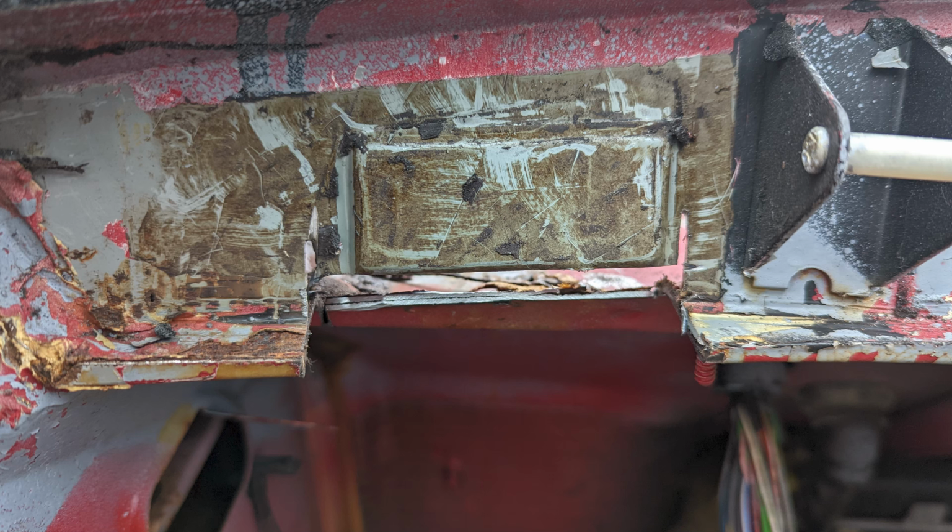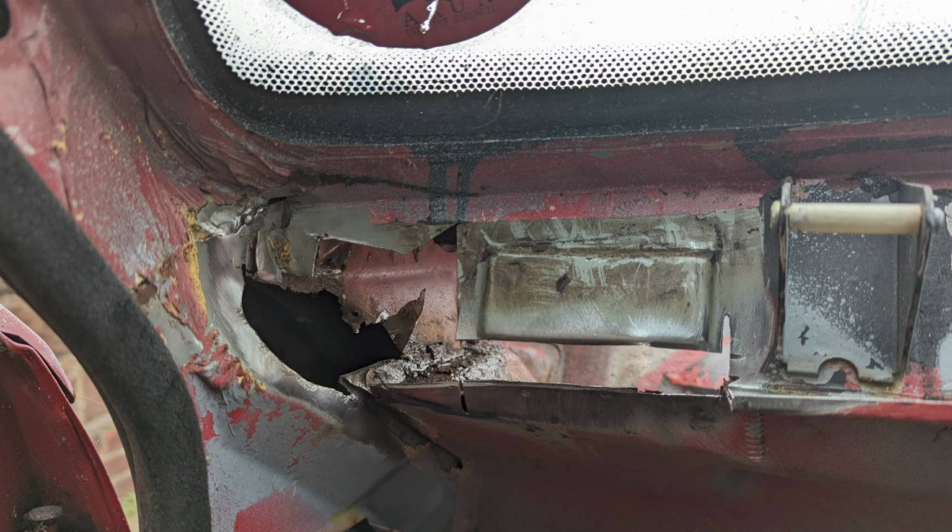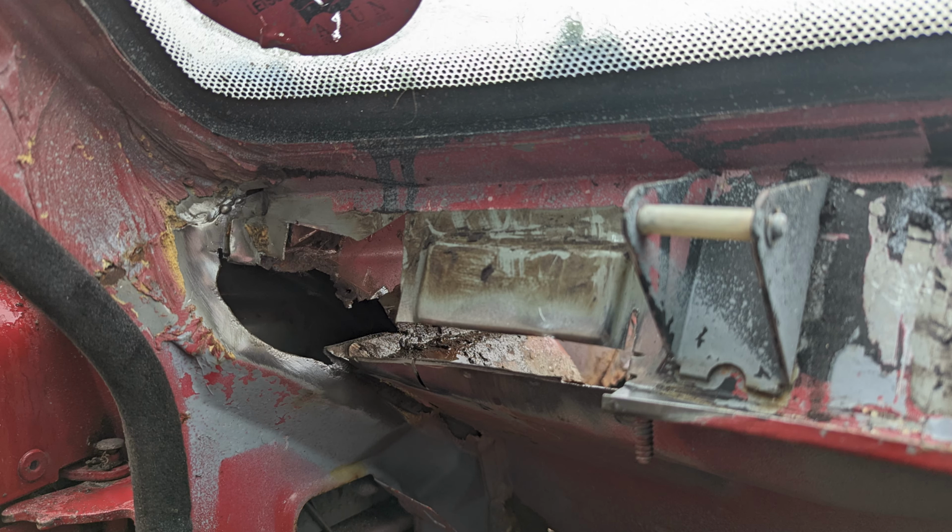So obviously these seams here are just where they've been pressed and then spot welded together by robots. We're going to be doing seam welding here, so it's not so important to keep those pressed sections. So you can see it's a bit of a hack away here. I'm limited by my tools here. This was the first cut. It did clean up before I started putting panels in, I must admit, because that would have been a nightmare to cut shapes for.